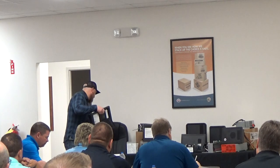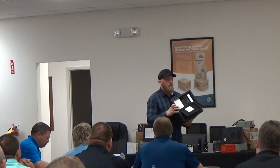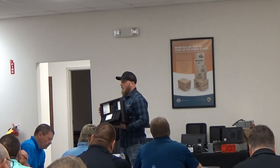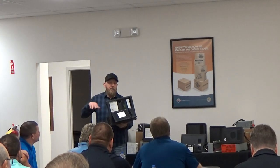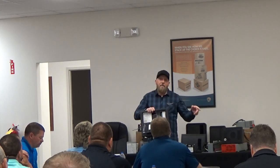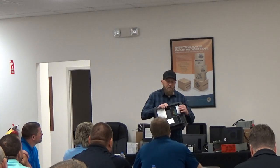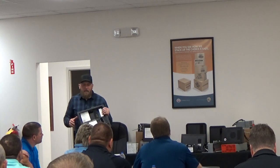If you look, it's kind of what we're talking about already. Noticeable flickering of the interior lights or the converter fans acting erratically. It's exactly what I was just talking about, is the battery can affect the way this converter is running. So a good battery is going to take the charge evenly and just dwindle down until it doesn't need to charge anymore. A weak or dead cell can trick the converter into saying, hey, I need to charge. No, I don't. So it can go back and forth. So with the fan going higher and lower, the lights can also flicker up more bright and more dim than just being a steady brightness.